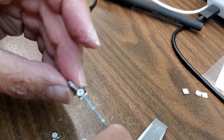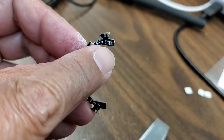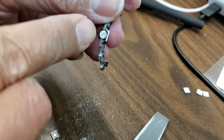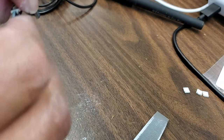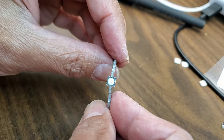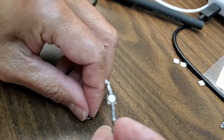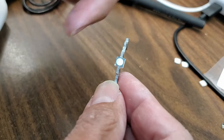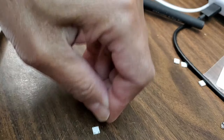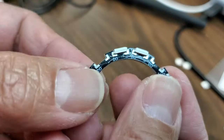I better pay attention to the orientation — make sure it's pointing the right way. So with the labels they put on there, this is the bottom, and oh yeah — that's backward. That triangle on pin three needs to be on the bottom left, so I did that one wrong. Yeah, it's off center but you could hardly tell because there's just not that much space. So bottom left — if I turn it upside down the triangle should be on the right side.